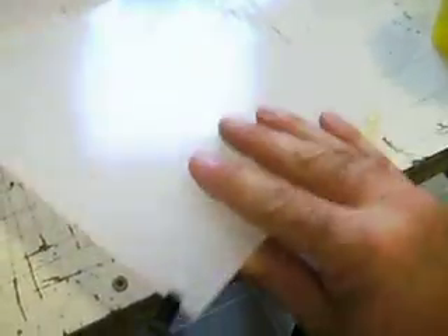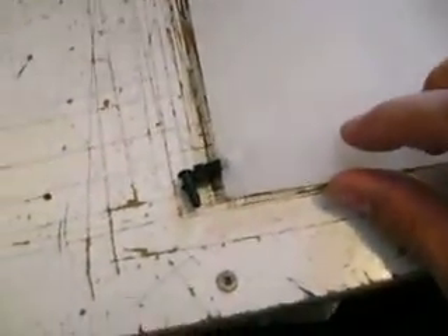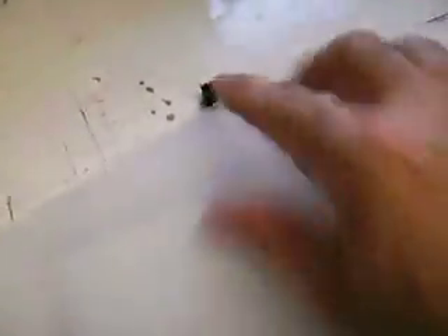This is the secret to the circulation. I drill a hole edgewise down to where the hole in the plate is located, so it matches up just like that. Then I drill a hole down through — not all the way through, it doesn't go to the other side — because if it does, then you have a breach in integrity. I do the same thing for the top, and what you end up with, with the gasket in place, is an entrance and a gas exit.